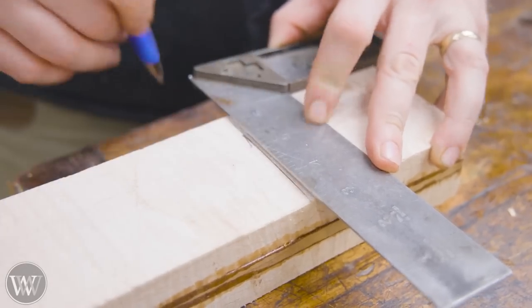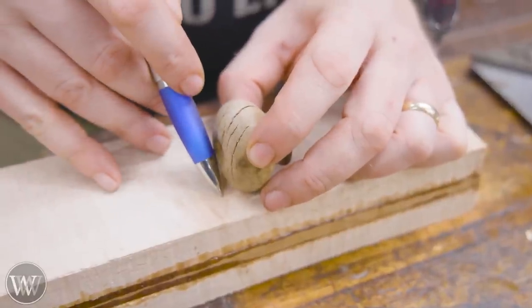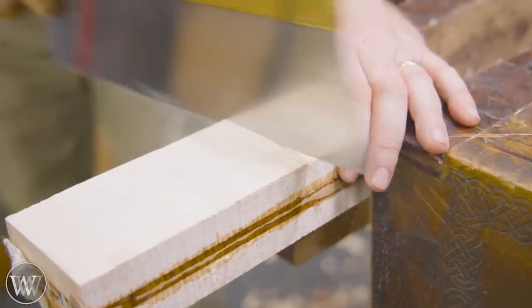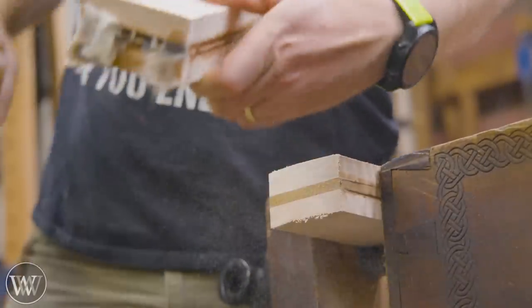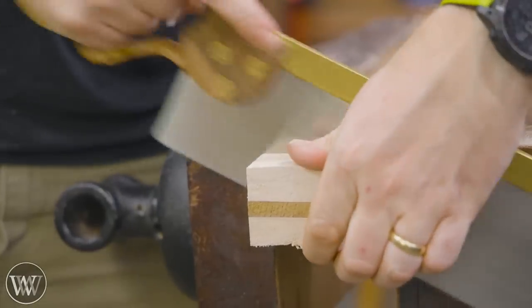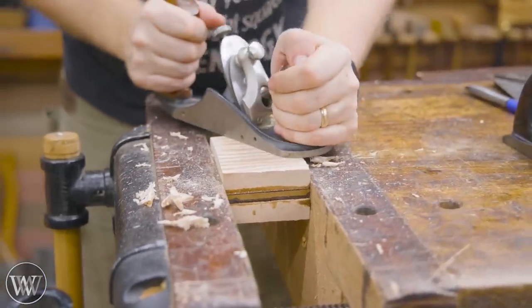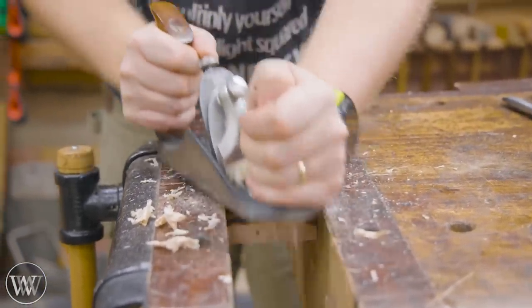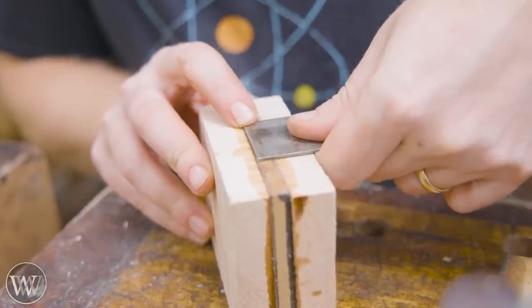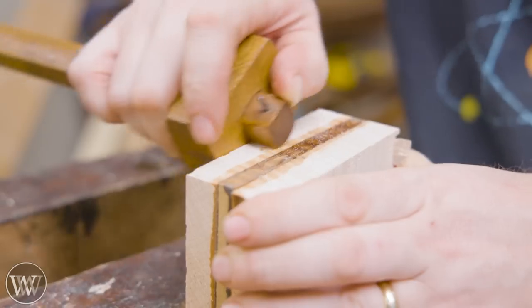This blank will be more than enough to get the knob and tote out of it. I made it a little bit bigger so I can pull another project out of it too, spacing out how much material I actually need. The tote — we're just going to cut that off and start working on it from there. I want to get a nice clean surface and reference it down. I'm also going to plane down the sides until they're the same thickness away from the middle, so we have the same amount of maple on both sides.